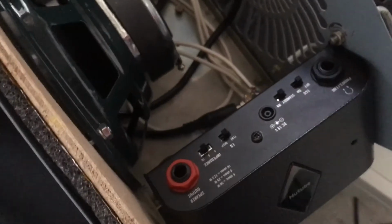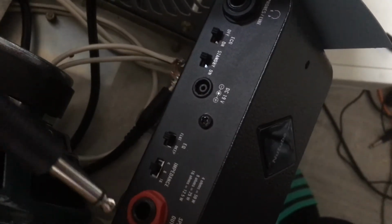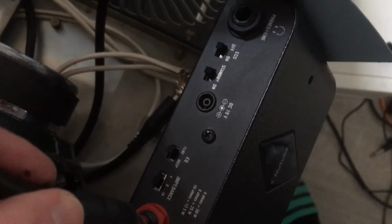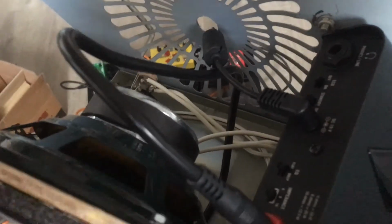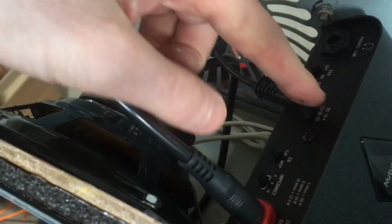I realised what happened was that I had created some kind of electric current loop, as the steel was acting as a conductor between the amp head and the speaker out. So I insulated the speaker out and the amplifier connection to the chassis with plenty of insulation tape inside and out, and this seemed to do the trick.